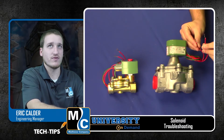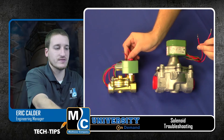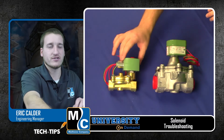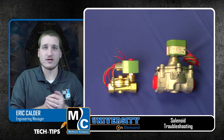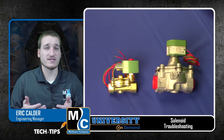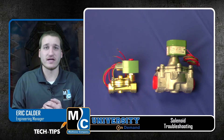They'll have two red wires — one will be power, one will be neutral — and they'll be on any solenoid. We'll disconnect the power from the solenoid and then go ahead and try to light your burner. It obviously won't light because we're not opening the safety valve to allow fuel through, but what we're testing for is to see if your safety circuit still drops out or if it allows you to continue running just without a flame.